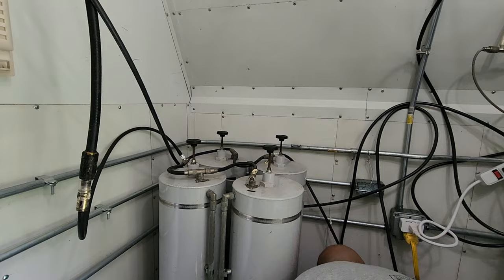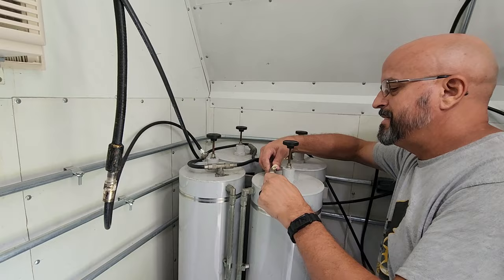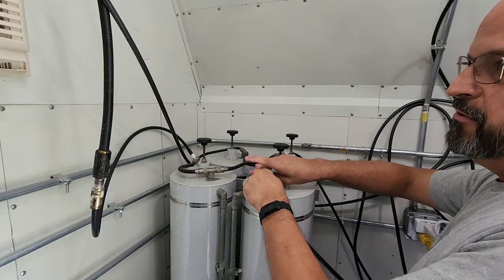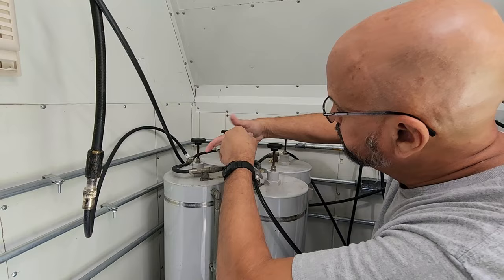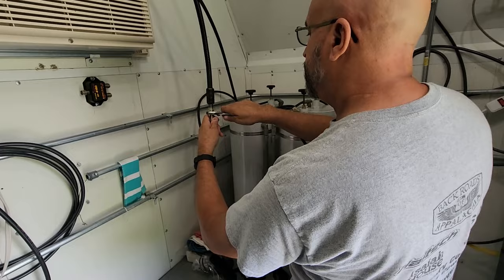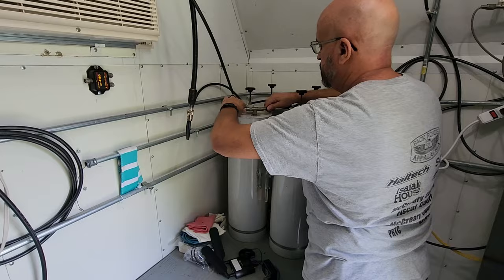We have a spare set of duplexers back at the shop, and we thought that would make a really good video. We can show folks how you can tune duplexers. There's the real proper professional way to do it with a spectrum analyzer and a service monitor to inject a tone. We're going to show you half of that. We don't have a working spectrum analyzer, but we are going to substitute a nano VNA at the very end. We are going to show you that it is possible to tune your duplexers without real fancy equipment — well, at least part of the fancy equipment.